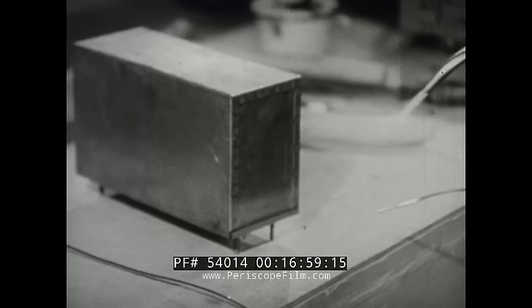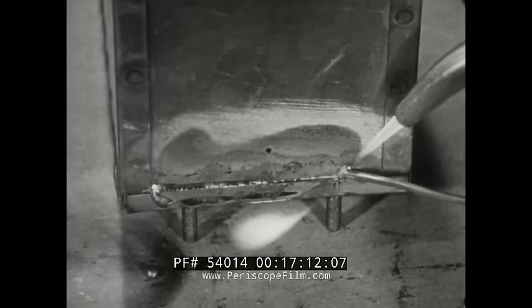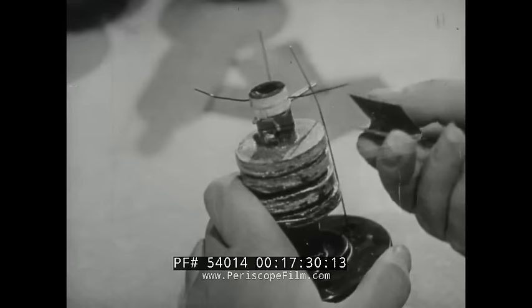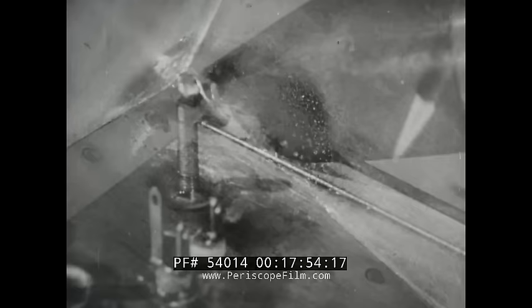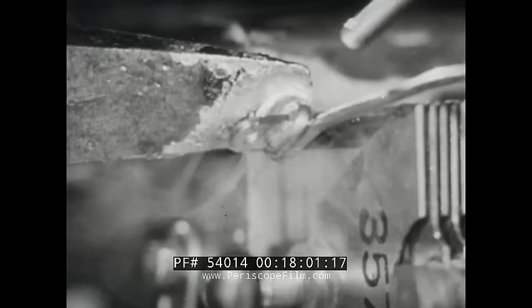The two end seams are sealed with a flame. The can and contents have been placed upside down on the bench so that the solder flows down into the seam. In this way, a pool is formed inside which provides an effective, airtight, waterproof seal. In the soldering of this assembly, procedures common to all types of hand soldering have been followed. First, the metal surfaces are cleaned so that the solder may contact the metals to be joined. To increase mechanical strength, the joint is sometimes fastened by bending and pinching, or by wrapping, or even by spot welding — strength should not depend on solder alone. Finally, heat is applied, then solder. Whether a flame is used or an iron, the work is heated first, then the solder is applied, and the heat is continued just long enough for the solder to flow throughout the joint.